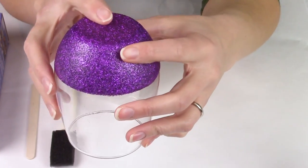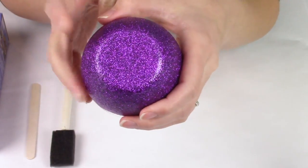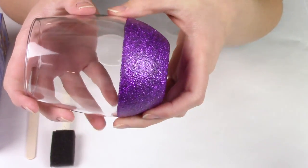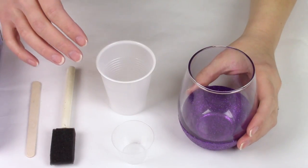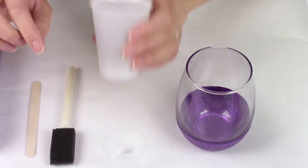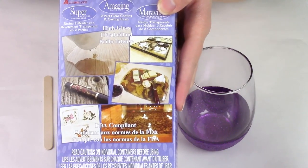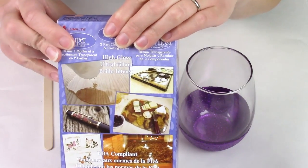Our final coat of polycrylic has set. The next step is to apply a two-part epoxy — this is optional. Polycrylic is limited food safe, but it can get cloudy if it's submerged in water, so if it's going to be washed a lot, I would go with the epoxy. The epoxy I use is the Amazing Clear Cast — make sure it is the high gloss clear coating resin system. If you get the mold system, it comes in a darker purple box and it will dry white, so don't make that mistake.